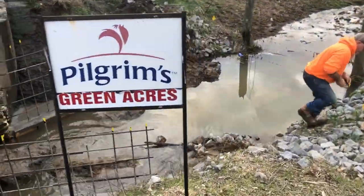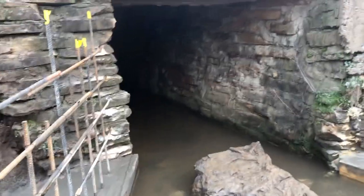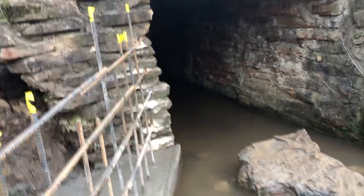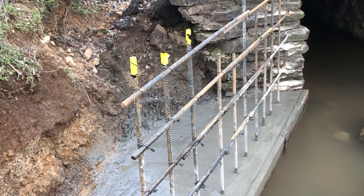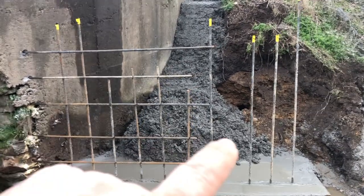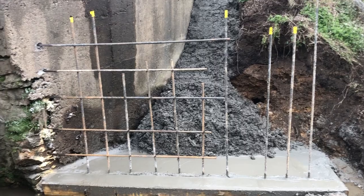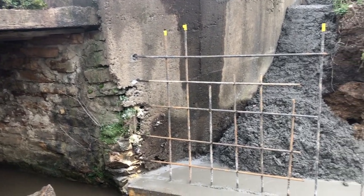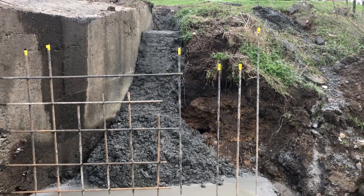You can see Toby taping up our caps there. You can see where we ran out of steel — we didn't have enough. We really didn't plan on putting our horizontals in today. We poured this footing this morning and went ahead and ran what steel we had. You can see how our wall is going to tie into the river stone — that's going to create a problem when we put our wall forms up. We have to make sure we fill in the gaps at the end to keep from wasting concrete. We just went ahead and poured the extra concrete out behind that wall.